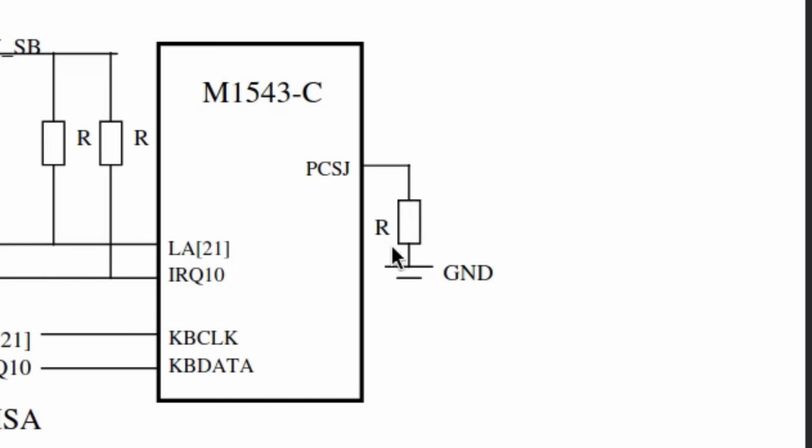And so far so good, the CPU has been detected as a proper K6-2 Plus 450. Let's again run some benchmarks. Okay, I couldn't measure any slowdown. The K6-2 Plus did not run slower than the K6-2 at the same clock. That's good news. The not quite so good news is that the K6-2 Plus was barely faster than the normal K6-2 as well.